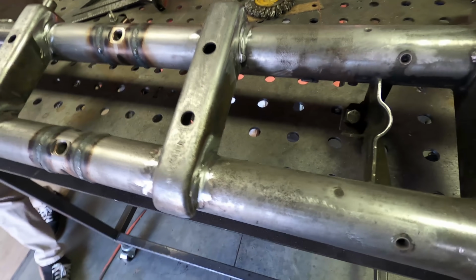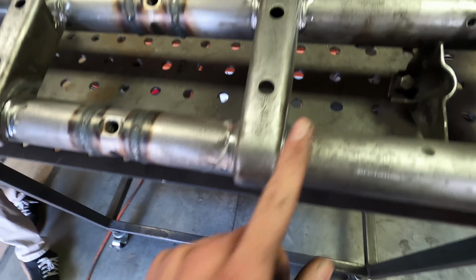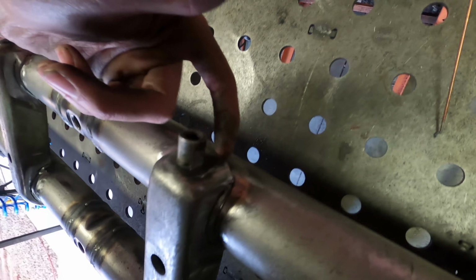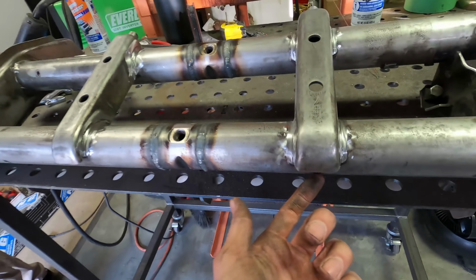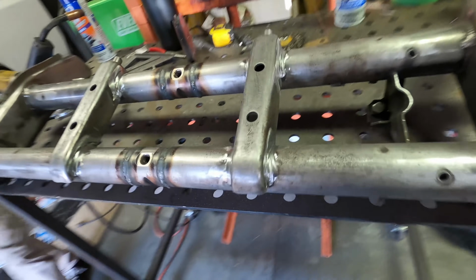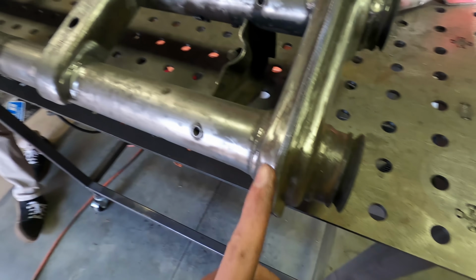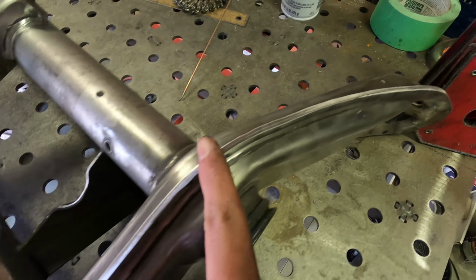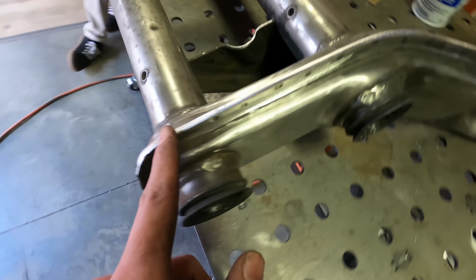The joints that we're gonna be welding are the ones that hold the whole mount for the beam on. So we'll go here, here, here, here. And then on the top up here as well, since that's not welded at all. And then we're going to leave the bottom how it is with a little gap, just in case anything gets down in there, it can still fall out. And then this whole seam right here, we ground down flat so that everything's sitting level with each other. And Christian's going to go ahead and TIG weld that together.